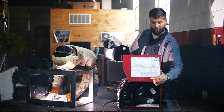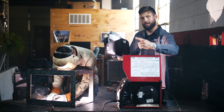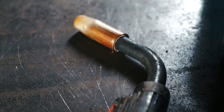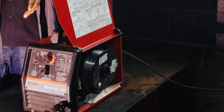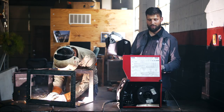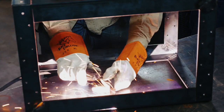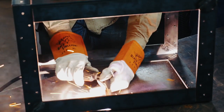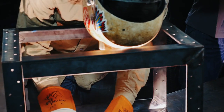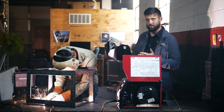As you can see in here, as he's welding, the wire is spooling off of the spool, going through the wire feeder, through his lead, into the gun. And then on the opposite side, we have electricity coming in through our work lead, our ground clamp, and back into the machine. You see the smoke coming off of the arc? That smoke is created by the flux burning up in the arc, creating an atmosphere and displacing the oxygen so that the iron doesn't react with the oxygen and create all those pinholes or porosity that you see if you don't use a gas.